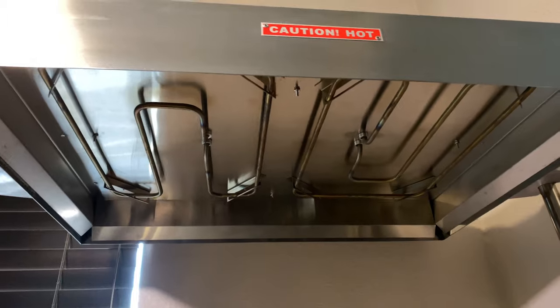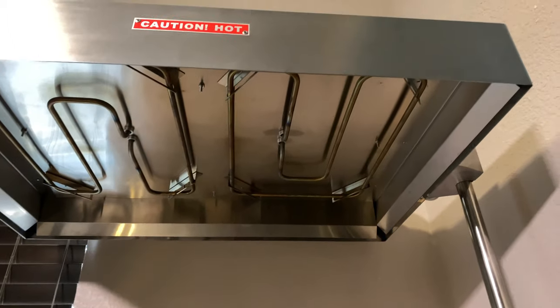There's a few reasons why I like using this product. The number one reason is it has a high temperature rating. The plastic is getting heated up by heating elements and, if you were to point a temperature gun at it, can go from 80 degrees all the way up to over 100 degrees. If you're using a material that is not meant for vacuum forming — for example, a material with a temperature rating of say 50 degrees — putting that plastic sheet over it could damage your buck or soften it up, and it could just collapse on itself from the vacuum pressure alone.